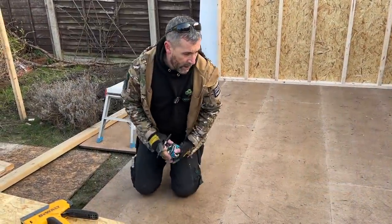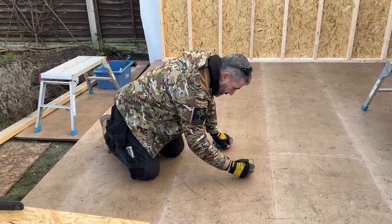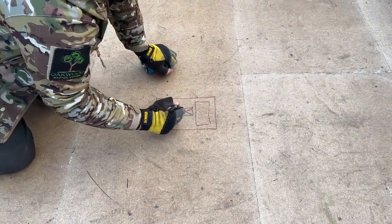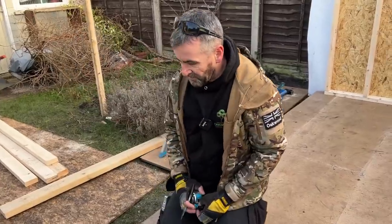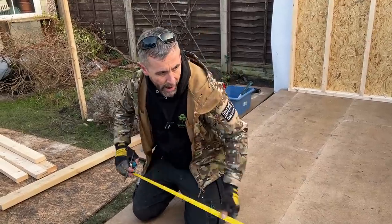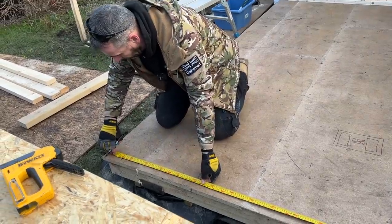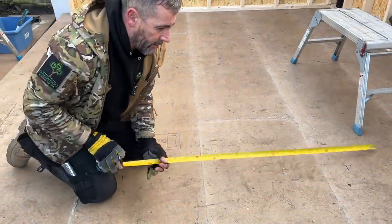This wall has got two windows. As viewed from outside there'll be a full height window there and a full height window there, and on the inside there'll be a TV on the wall in the center. What we're going to do is work it out so we can get it centralized internally — it won't be quite right externally because the front wall is thicker, but internally visually it'll be right. That 5x2 is where my wall comes to — measuring that, it's near on 10 feet, so that there is the center of my wall.